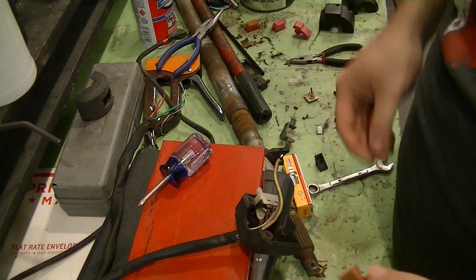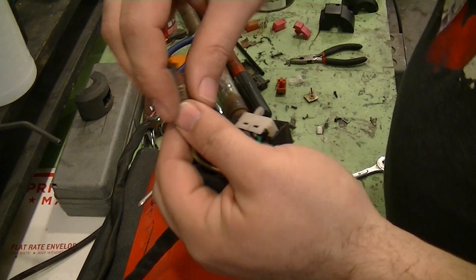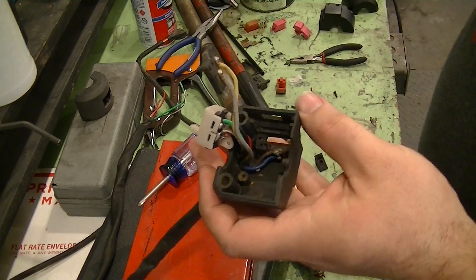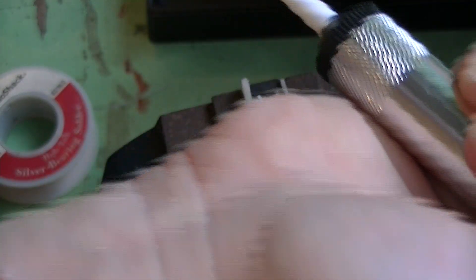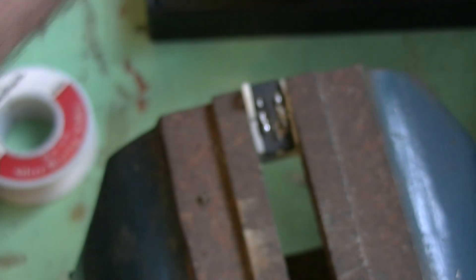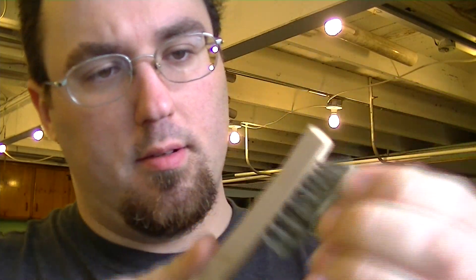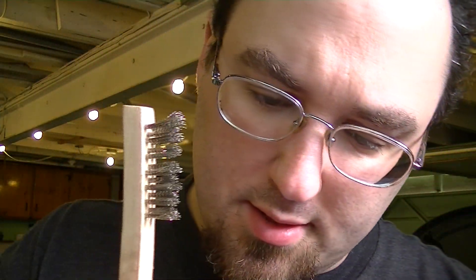I'll set all this off to the side — don't lose the ball. Now at this point we can clean the housing down. I'll go ahead and clean my contacts off. Clean everything out real well. Now we should be able to desolder the switches, get everything out of the way, and start reassembling the new one. To remove the excess solder, I'm just going to use my little solder sucker here. Be careful not to melt the sides of the nylon. Now I'm just going to take the switch and clean it down with a little wire brush to clean the excess gunk out of it.